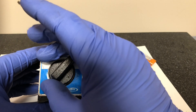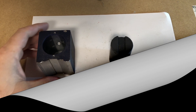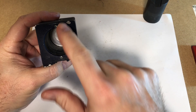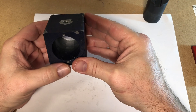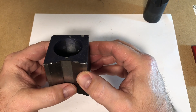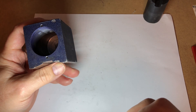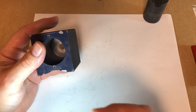I have tapped this to 3/8-16. Reassembly — time to put it back together. Now that I have my hole drilled and tapped, luckily a little something stuck on the actual bolt. Let's install our spacer plate. You can go this way or that way — it doesn't matter. All it does is stop it from slamming up and sticking against the other side. Now I'm about ready to put this in.